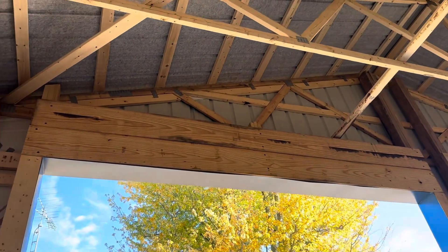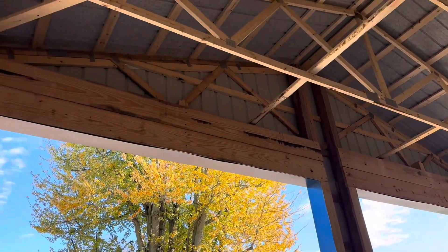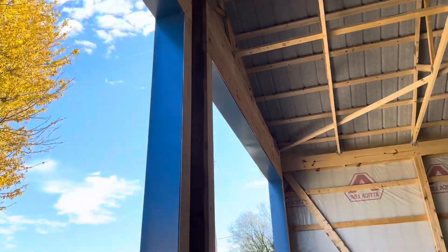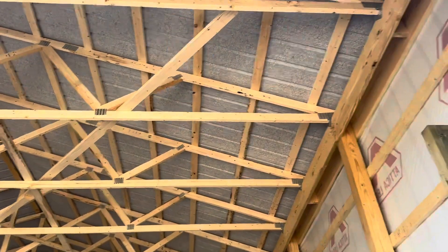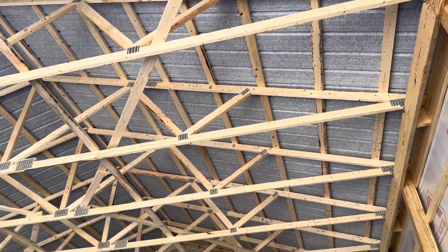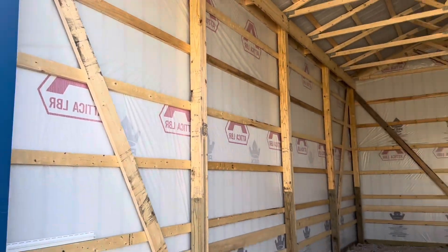We're using two-by-twelves. We are spanning 12-by-12 overheads. Four-foot on-center truss spacing. That's a drip-stop metal — I haven't talked about that in a while — and you can see it acts as the vapor barrier. It comes pre-assembled, pre-applied underneath that roof metal, which would be blue. Our trusses — we get the engineering specs out of Chicago from iTech Engineering, so we clear span with them.